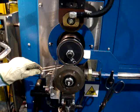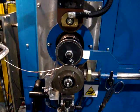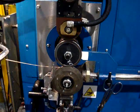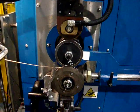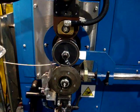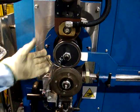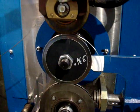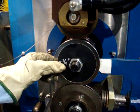The flexible graphite filler is removed and the gasket is completed by having a few more wraps of metal at the OD of the gasket, then securing spot welds around the entire OD of the gasket. Notice the spacing on the ID welds.